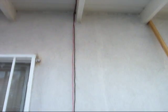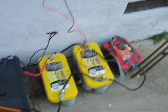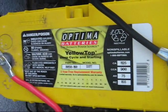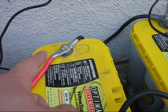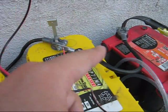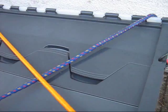All that power goes down from the top of the roof and goes from that controller to the batteries. These batteries are Optima batteries — quite possibly one of the most expensive batteries, but they are the best for this use. Notice also how they're connected: positive with the positive, and then negative with the negative, with more batteries in here.